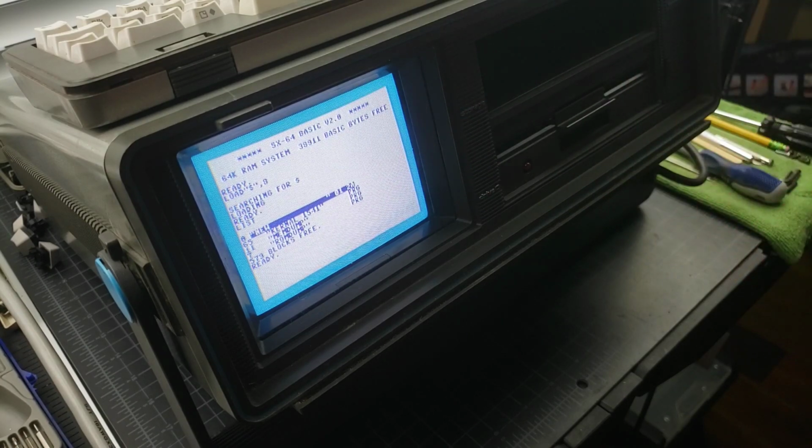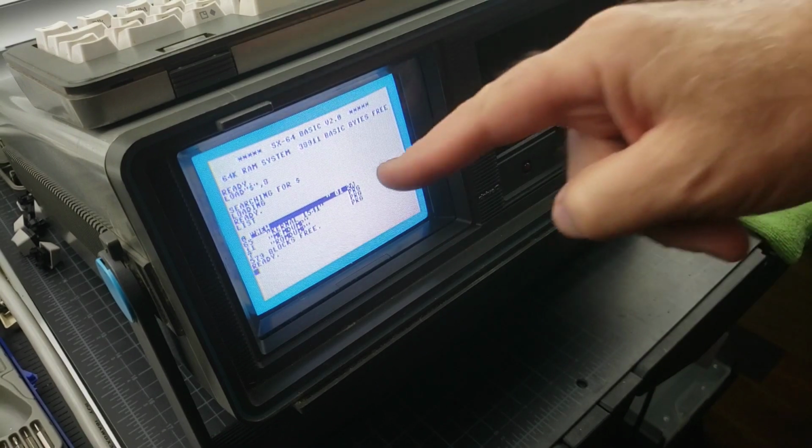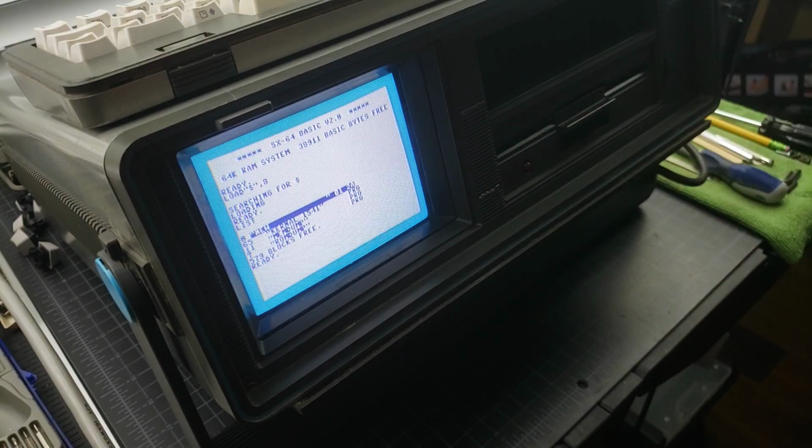And again, if I run it again with JiffyDOS, which I intend to get the JiffyDOS contents of these ROMs, it will overwrite this. So I'm going to rename this and then do this again. So I won't go through the process again. You get it. So if you want to dump ROMs and you don't have a 28-pin, the 24-pin converter for your TL866, this is the program to use.